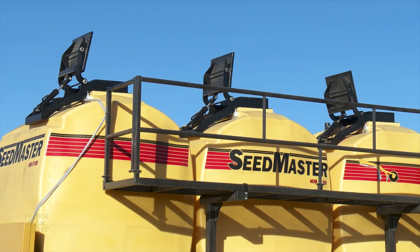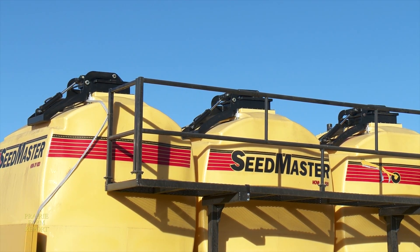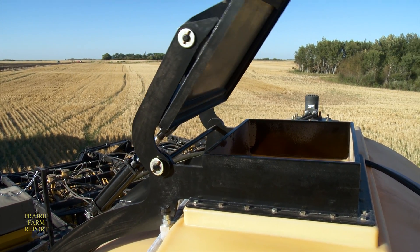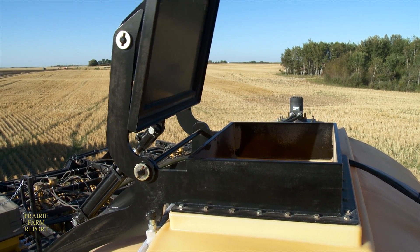Another convenient operating feature is the hydraulically operated lids on the tanks. The air pressure in the tank is significant — there are several hundred pounds of push on the bottom of the lid. Bojo decided to use hydraulic cylinders with an active force pressing the lid down at all times. The system gets that active hydraulic force from the fan itself, so if the farmer is running the fan at higher pressure and there's higher pressure in the tank, it automatically seals harder. It ended up being very convenient — you can open and close the lids without having to even climb up on anything.